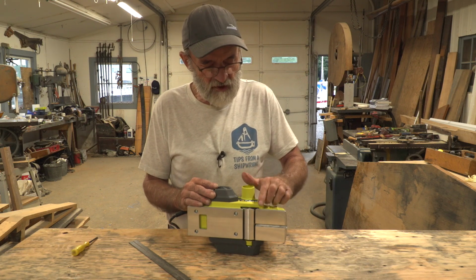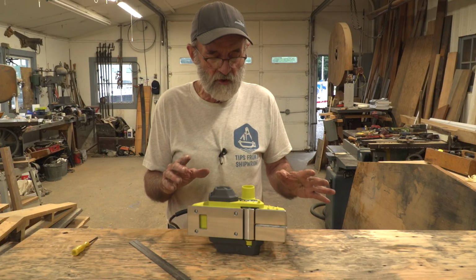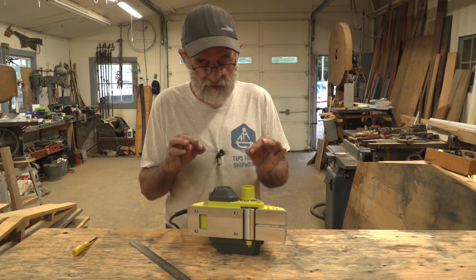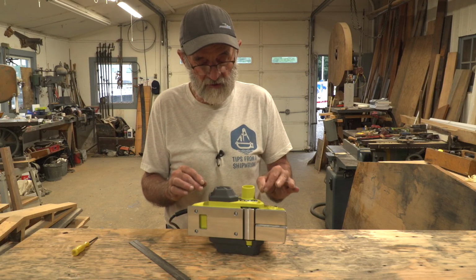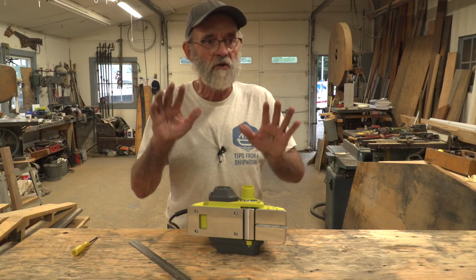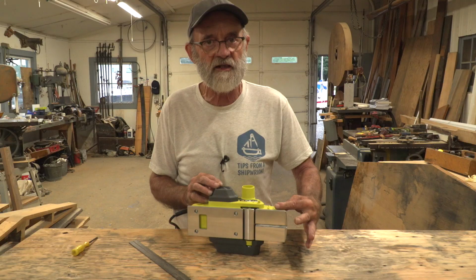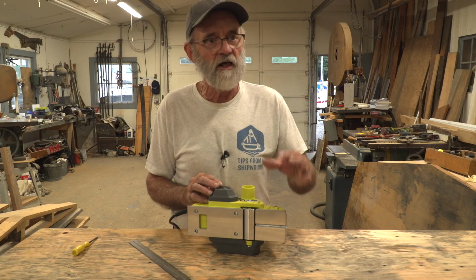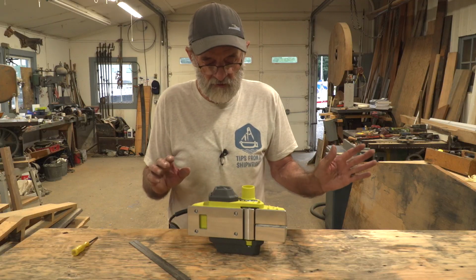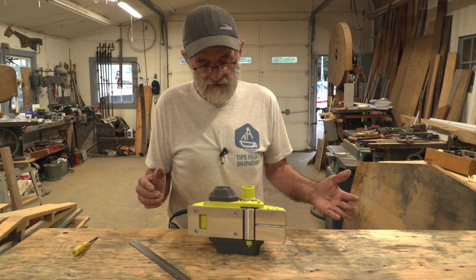It doesn't cut the same depth on both sides, and it's just not going to work really well, especially when you're trying to do something like finish work with it. Because you can literally take a planer like this one right here, I can literally fair a hull with it right down to almost sanding. But if you have that inclined plane in there, you're going to get yourself in trouble on a real flare or fair or a real flat surface. So this one, like I said, rises straight up and down, and it works great for me.